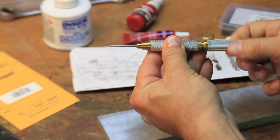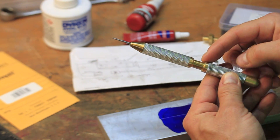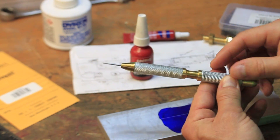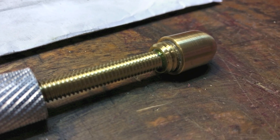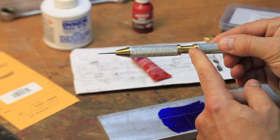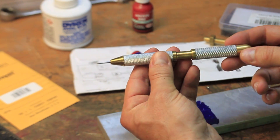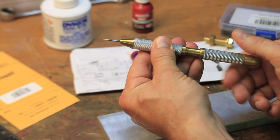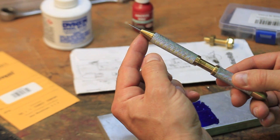The remaining six pieces that make up the body are made of brass and aluminum and held together by threaded fittings, with the exception of this extra decorative trim piece that was pressed into the aluminum grip piece and held in place with some green loctite. The inner piston is threaded through the middle brass piece and finally threaded into the back cap and secured with green loctite as well. A touch of red loctite was used to hold the back cap onto the back aluminum grip piece, as well as hold the middle back brass piece onto the front aluminum grip piece. The red loctite is to hold the brass pieces to the aluminum grip pieces mostly so that the least resistance is found in the piston and the scribe body doesn't come apart unintentionally when advancing or retracting the tip. The brass tip was screwed into the front aluminum grip piece and ended up being so tight that it stayed in place and loctite wasn't needed.